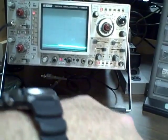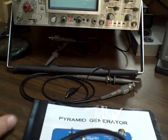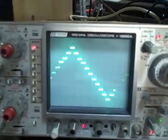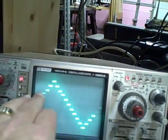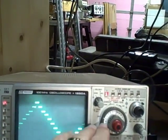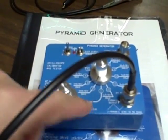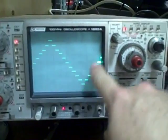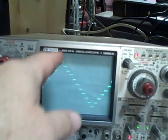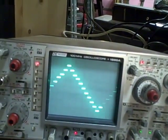It's a whole lot easier to demonstrate than explain, so let's try it. Right now I'm on the lowest range: two milliseconds per division for the square waves, 50 milliseconds for the waveform. I have my scope set on the five millisecond per division range, and I see that I've completed one complete cycle in ten divisions. Ten divisions at 5 ms/div gives 50 milliseconds — exactly what the range switch indicates. So I have a 50-millisecond triangle wave composed of steps: I go up ten and down ten steps in 50 milliseconds.